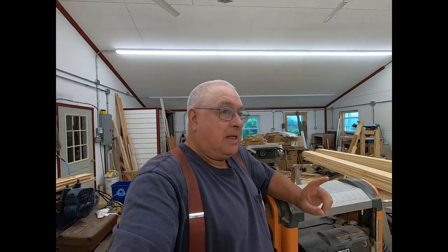And then you run it through a merry-go-round or spin it either way and run it through again, flipped the other way. The other way is to use a sawyer's favorite, which has a dog on bottom, dog on top. You put the piece so that the round part's down, and you just grab one edge of it and you come across it. You don't get 100% vertical grain, but you get real high quality wood. The only way you can get better quality wood than quarter sawn is if you go to rift sawn. Now rift sawn is the best you can get. It's the most expensive to saw.